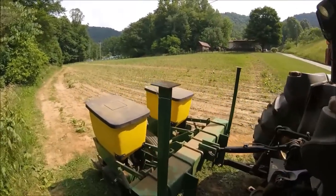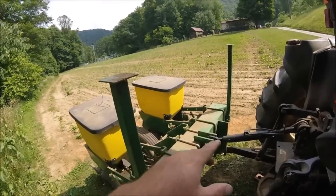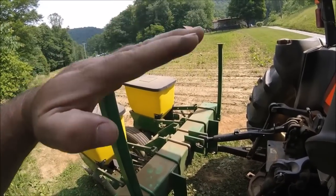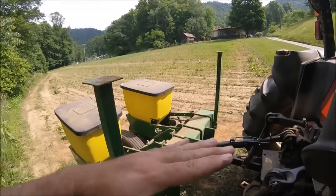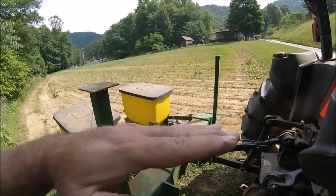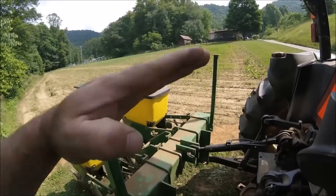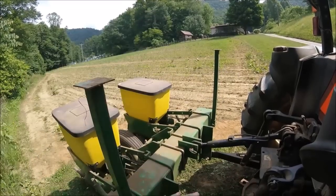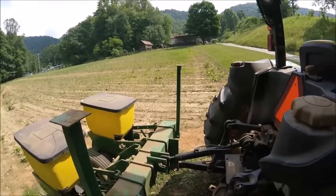The goal is to adjust the corn planter with the top link so that I can let my lift arms all the way down and have the planter float in a level position. If I only make contact and level it at a fixed lift arm position, going over a hump will pick the planter up. I want the full weight of the planter all the way down and then level it — so I adjust the top link to do that.